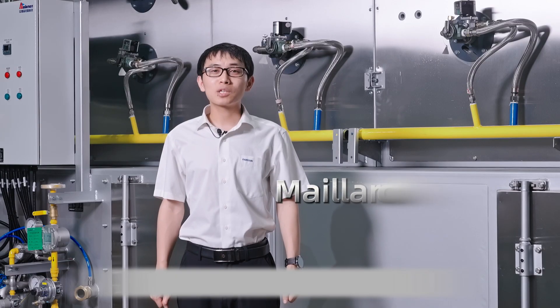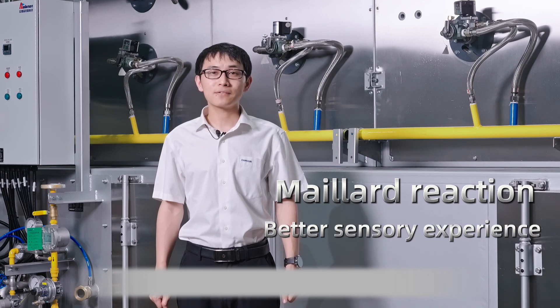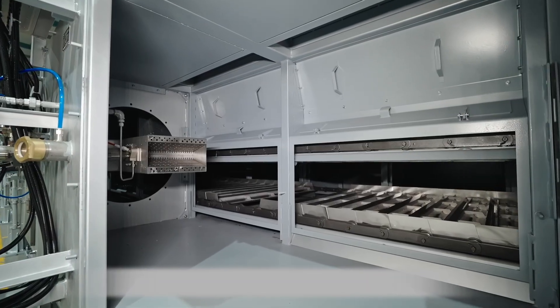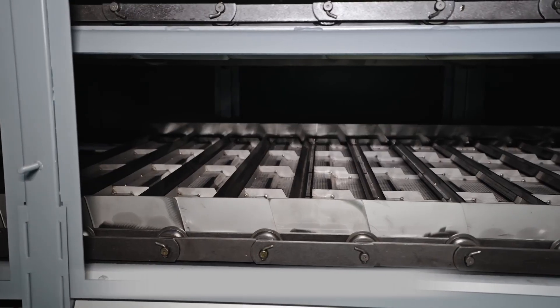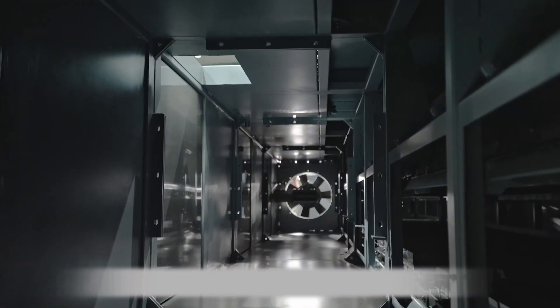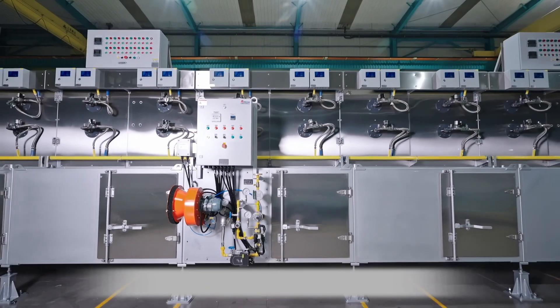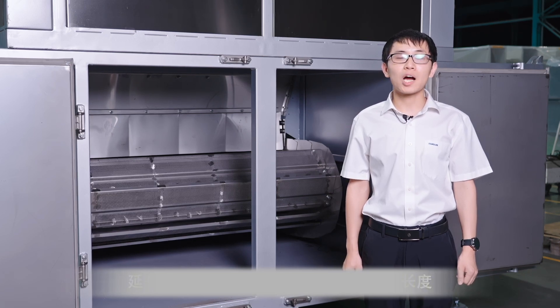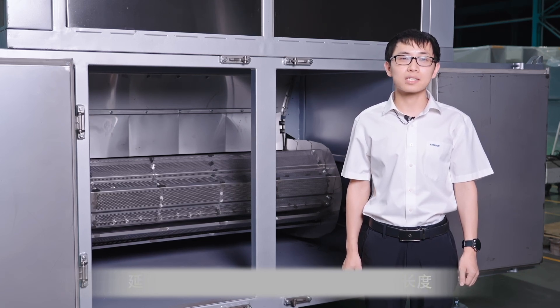The protein in meat gets a Maillard reaction and gives the products a better sensory experience. The dryer at the bottom adopts the low temperature and long retention time drying solution. During the drying process, the moisture is uniform. The multiple zone dryer is designed with a hot air recirculating system, improving heat efficiency and reducing energy consumption. The special belt design prolongs the drying time and reduces both the height and length of the machine.